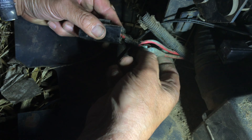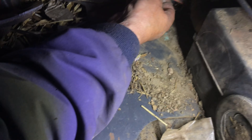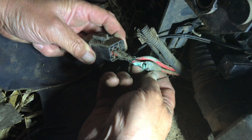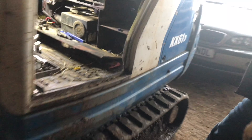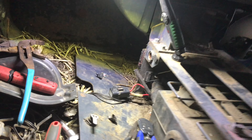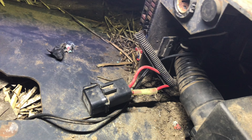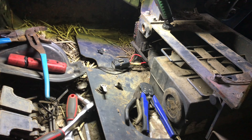So if you're having trouble with your Kubota KX61-3, check the 60 amp fuse underneath the seat. Success! We put it together like a farmer should. There's the repair - it's a bit of heat shrink, we're just going to wrap it up. Cheers!